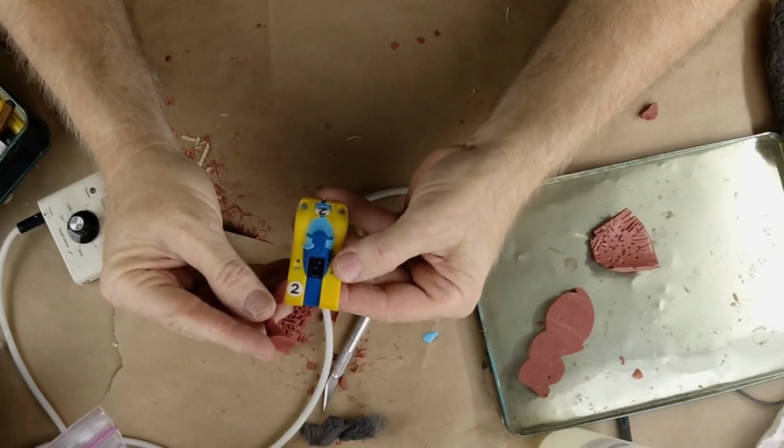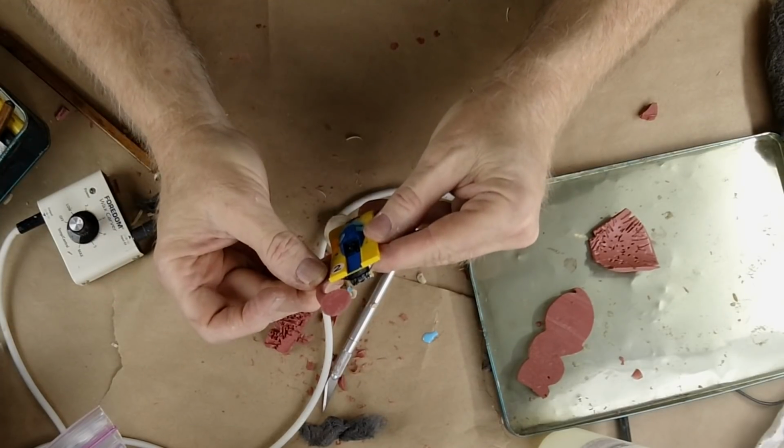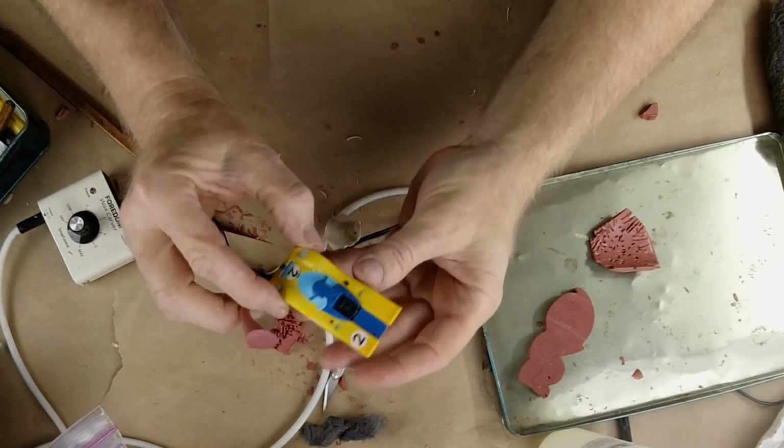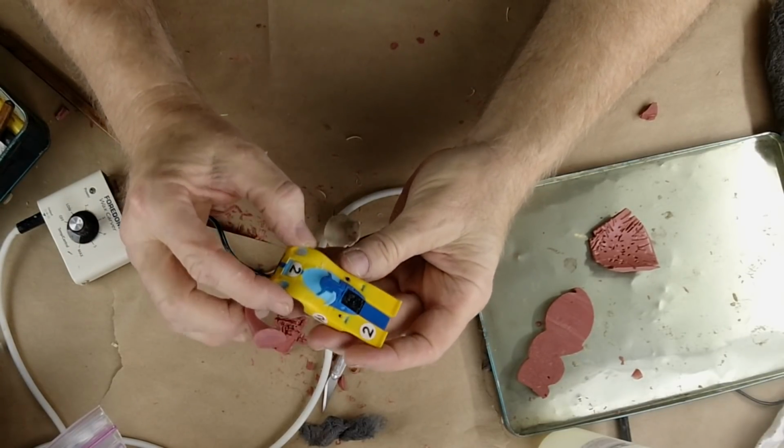We shall see. Let's finish preparing the rubber. So we're going to put the sprue on like this. That's going to be the funnel that's going to flow the resin into the model. We're going to put on some vents, and we are going to be ready to go.